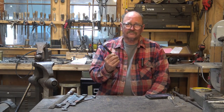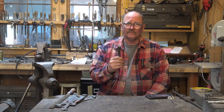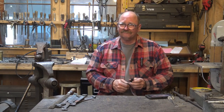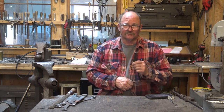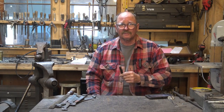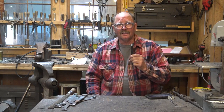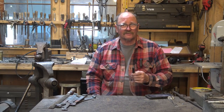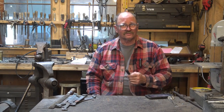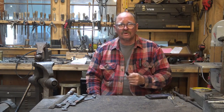I have no idea what stress this steel has been through previously. I may not have relieved enough stress when I normalized it prior to forging. The big lesson for me is just another example of why using salvaged steels to make tools has its problems — it's still doable, but don't make stuff out of old steel to send out to customers. There's a real risk there. Instead of using this, I've drawn out a piece of new S7 tool steel — a three-quarter inch drill rod drew out to half inch square, cut off a three inch piece, and forged a new slitting chisel out of that. It is annealing as we speak and tomorrow when it's cooled I will grind it. I think things will go much better.